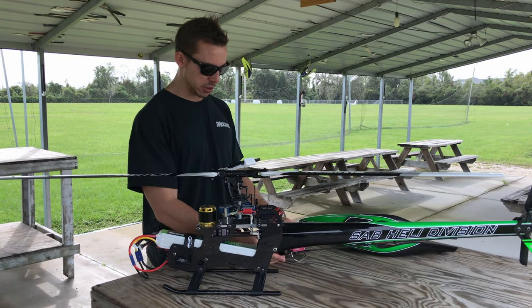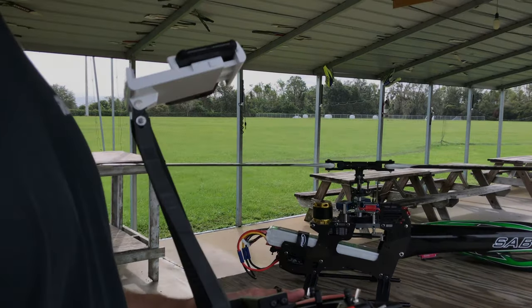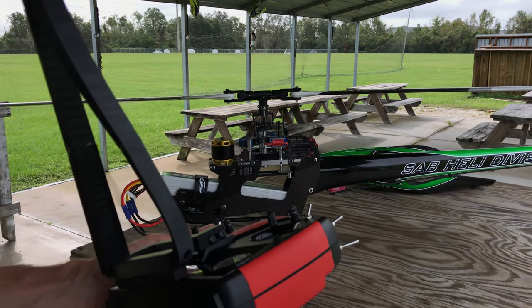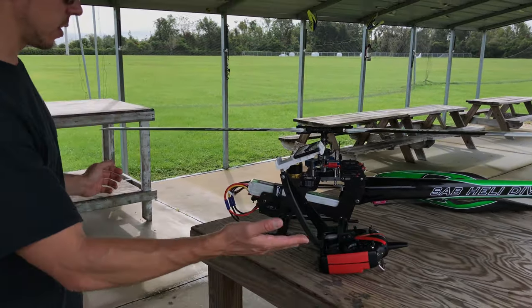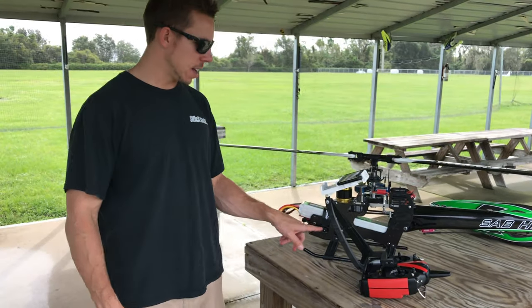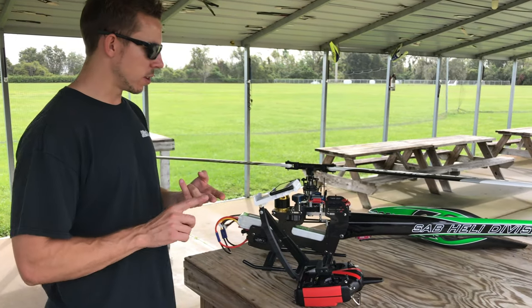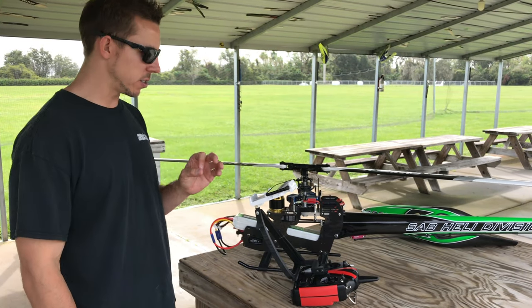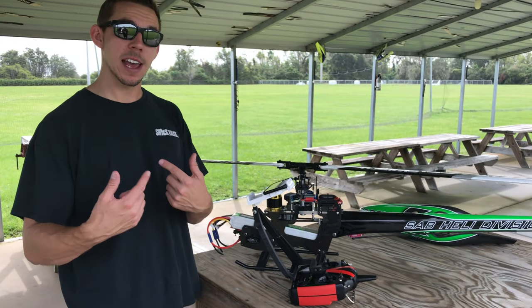First one, Talking Telemetry, where if you can hear, if I come over and flip my switch before I even fly, just flip the switch. Battery voltage 50.1 volts. Used 0 milliampere hours. Okay, perfect. So I've got this set up on the trainer switch, which I love. This is using my Tribunus ESC telemetry that's coming back, and it tells me my voltage and milliamps used. So I don't even have to check my battery, I flick it, I hear 50 volts, I know I'm fully charged. 0 milliamps consumed while I haven't even flown yet. The milliamps is more important after the flight.